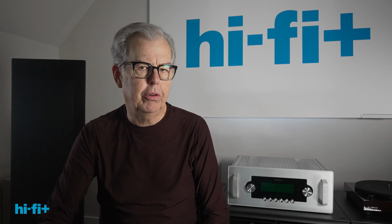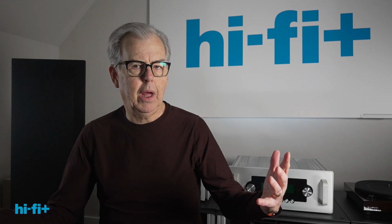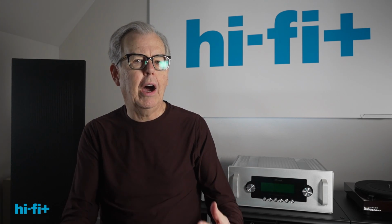Let's call it 200 hertz for the sake of discussion, since many people will have slightly smaller listening rooms, and that will push the Schroeder frequency up a little bit higher. What that means is if you're going to use a subwoofer to smooth out the bass response and give you even bass, you need a subwoofer that can go up at least to the Schroeder frequency.